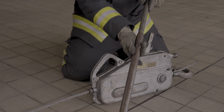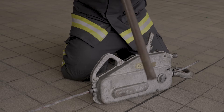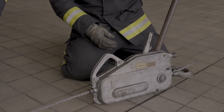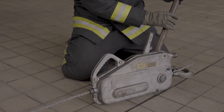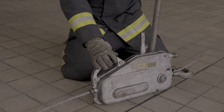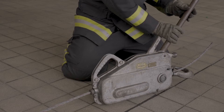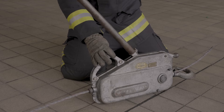We've got the telescopic handle — bring it all the way up until we find the little pin, make sure that goes in. Remember, reversing is on the top and the forward motion is on the bottom lever. We can now operate the Turfer winch — forward is back and forth with the lever. If you need to use the reverse, take the lever back off, insert it on the reverse lever and it naturally picks up the opposite direction.